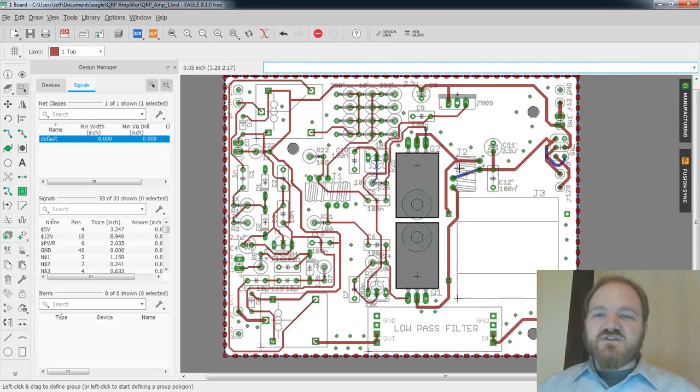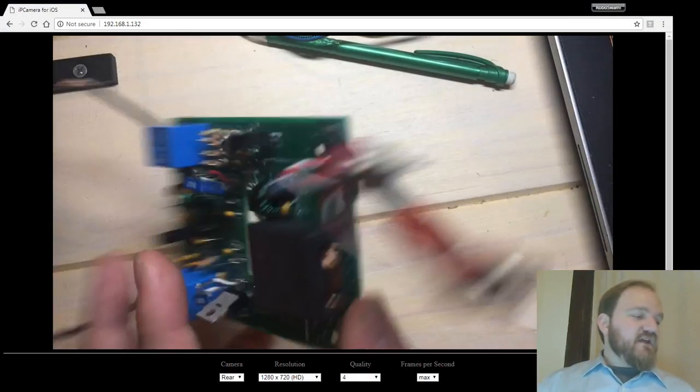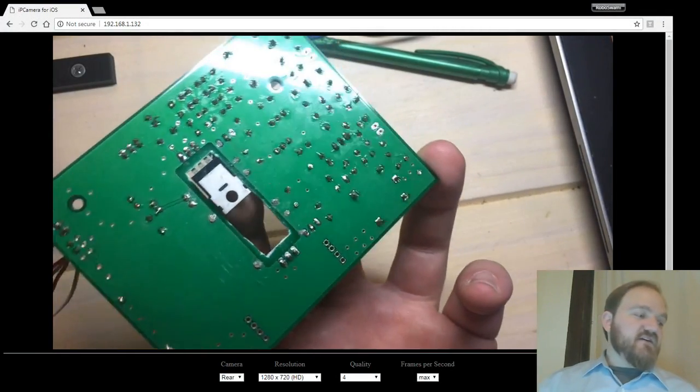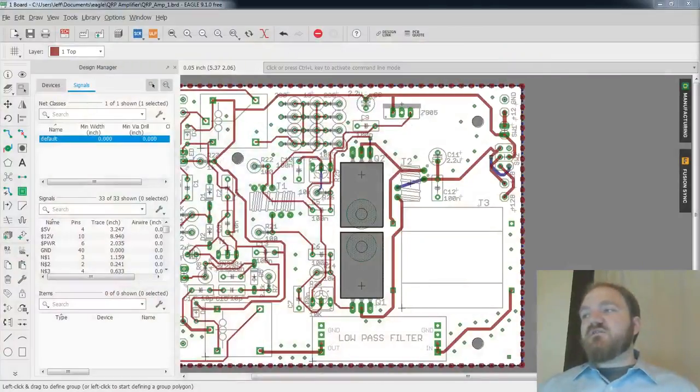I looked at trying to do FETs mounted on the edge of the board, sort of like old school audio amplifier style, and then you put your heatsink off the back of your enclosure. And I liked that. The only thing I didn't really love about it is I think that would be more constraining as far as your choice of heatsinks. With the design here, you literally could use a CPU heatsink because you're really only covering a square inch. Whereas hanging out the back, you have fewer choices of what your interface layer could be.